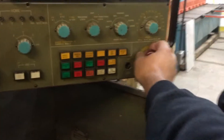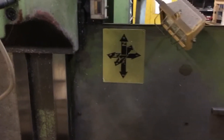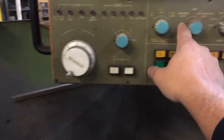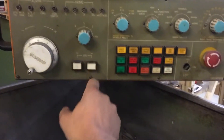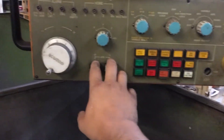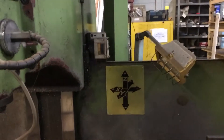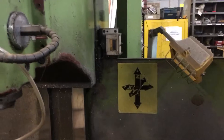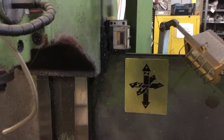Turn the machine on, press power on, twist this, and then hit reset. What I want to do is make sure this is off the limit switch. Go into home and on each axis you're going to do plus all the way. If the switch is above this it's going to over-travel, do an e-stop, and then you have to loosen the belt. So just make sure you're off your sensor.